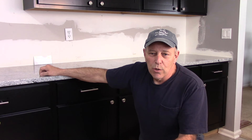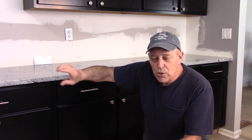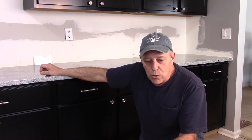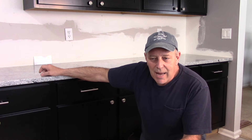You have alternatives when you purchase cabinets or if you just want to upgrade them. You could put a piece of wood across there and face nail it. You could put on that rubberized molding that goes on the bottom and glue it on. But in this case we're going to put on tiles — we want the tiles to match the floor so that the floor and the toe kick area are exactly the same.